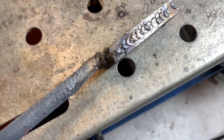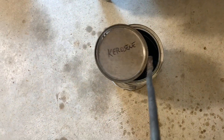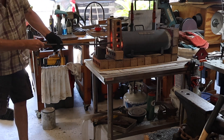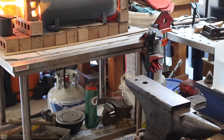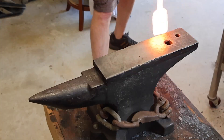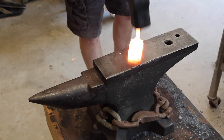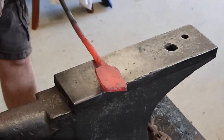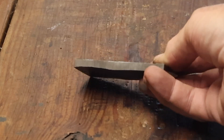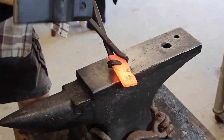So I welded the edges with my big welder and soaked it in kerosene. I didn't use any flux — I just went straight into the forge with it and then forge welded those two pieces together. Initial light blows and then slightly harder blows once I felt like I had a good forge weld. Just to verify that it did weld together, I cut the handle off and ground the edges down so I could see it. It looked pretty good, so it was going to work.